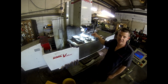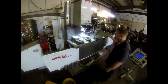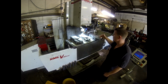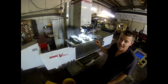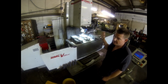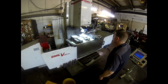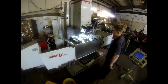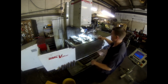My little contour to clean up that step that was in the other one. I have to do a horizontal. They've already faced it, so kind of funny. Which on this I am staying off the floor with the contour and off the sides with the horizontal. So end mill's only cutting on the bottom or the sides and not both sides. Doing little pegs on the back now.